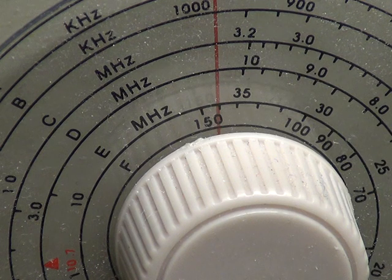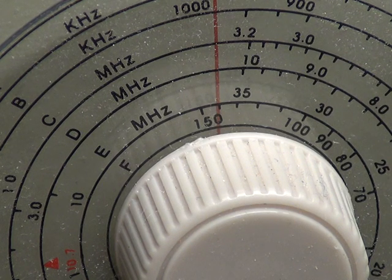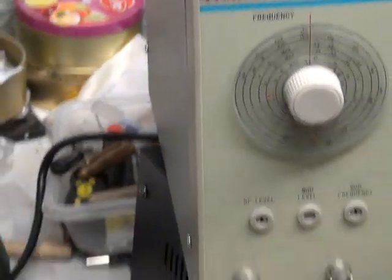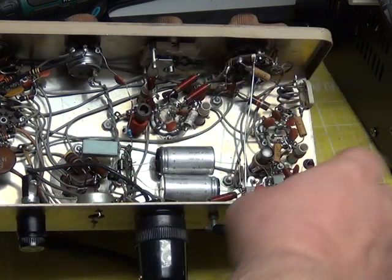As you can see, it's a very basic signal generator, but it's about 145 MHz. And as you can hear, we've got the tone there. I'll get it on our proper test set, which will be off camera, and we'll just make sure. But it is a tunable receiver — of course it's super-regenerative, so the selectivity is just a load of rubbish. When in use, because I've every intention of using this radio, what we'll actually do is use it with a scanner on receive for anything serious. So I'll just pop the signal generator off.